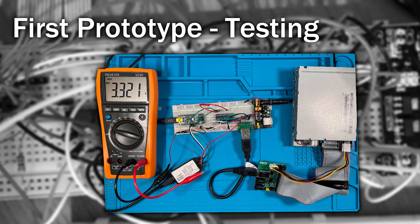On the left you can see an Arduino. I'm using this to provide a simulated user port so I can test the IO functions. In the middle I have a 5V to 3V logic level converter, again to simulate the environment. And finally, I have a floppy drive connected up to the prototype board. There's not much to show here, but it does actually all work as expected once I've made a few modifications.